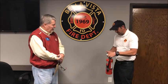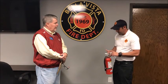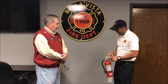Wherever you put the extinguisher in your home, leave it there. Don't move it somewhere else because another family member may not know you moved it — if everybody knows it's under the sink, leave it under the sink. Also, always leave the tag tab in place. It breaks easily but it's not an issue when you go to use it. That tab also tells you it's never been used — it's a good indicator that nobody's sprayed it, and you can confirm the pull pin is still in place and it's good to go.